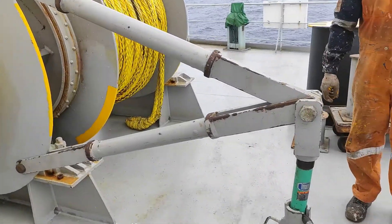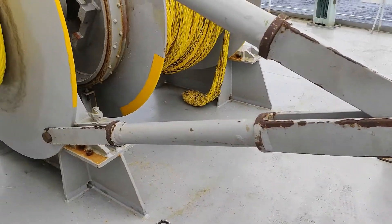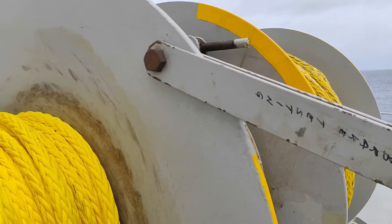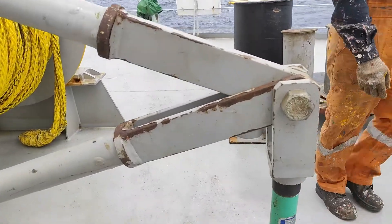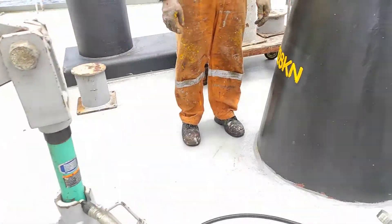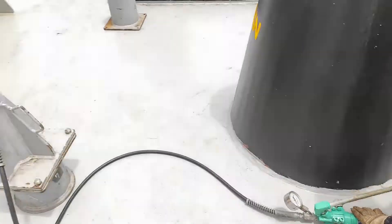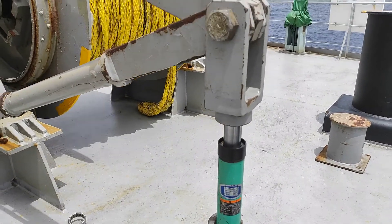This is the way we connect the equipment to the upper and lower part of the mooring drum. After securing this, we start pumping and make sure that the pressure on the gauge shall not be more than the set pressure.